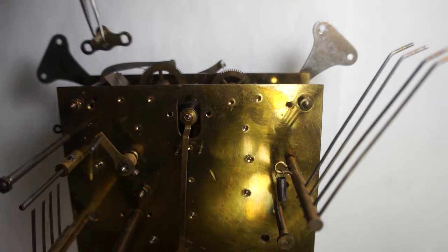So this cream of tartar has been applied. It's time to rinse it off. So the chapter ring is all silvered and it looks real good. Now I just need to go over the numbers with some black shellac.